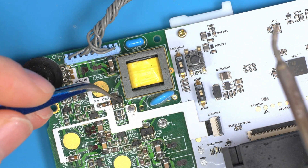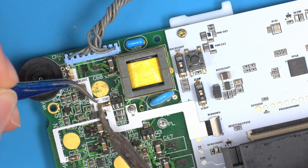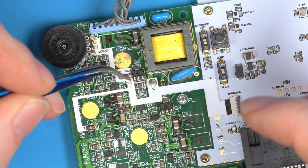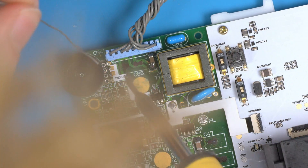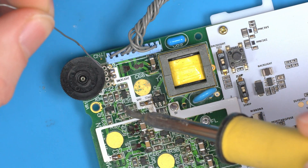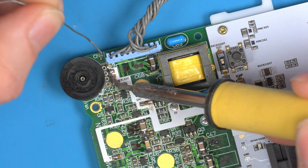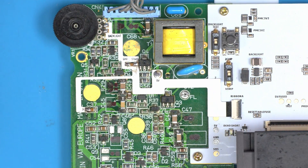The start and ground, with the transistor being in the way, means start kind of sits up — which is fine, as long as you get the solder. It gives a little bend on the ribbon but it's the only way of fitting that in neatly. For the backlight, you want to pre-tin — this is probably the most awkward part of the install now. Pre-tin the wheel itself as well, and once you've pre-tinned both, it flows in nice and easy. That's all there is to that side of the ribbon.